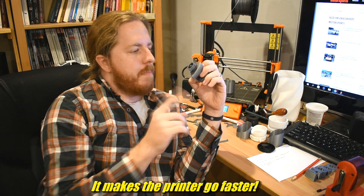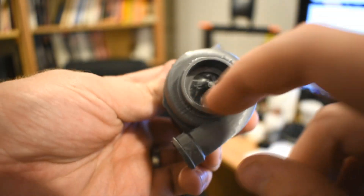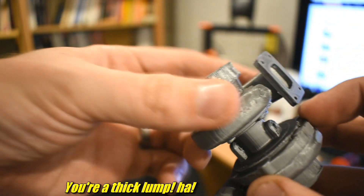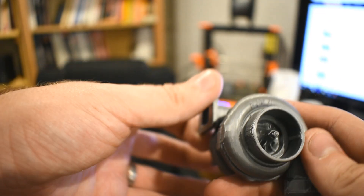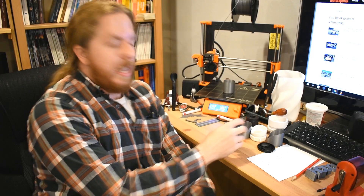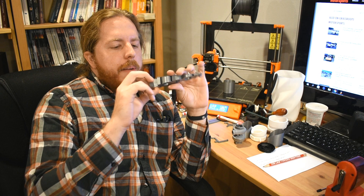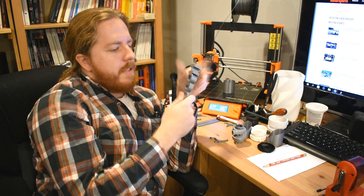But it has some of the same problems as the mug. You can see here, like, this would be this pipe sticking out in this flange — that would be difficult to burn out. And since the impeller in here is just for looks, this would actually be one thick lump, and then another thick lump connected by a thin spot, and that wouldn't solidify in a nice, predictable manner. That would end up with a lot of problems when the casting came. Because in real life, these aren't cast all in one giant lump — they're like pieces, and they're hollow. And then I thought — I was watching Game of Thrones — I'll do a door stopper! The problem with this door stopper is also varying thickness. I have a good idea how I would sand cast this, and also how I could do runners and stuff. But to do it best with lost PLA, I think you would have to do it vertically, and I don't have enough space. So door stops out too.